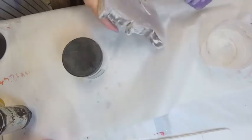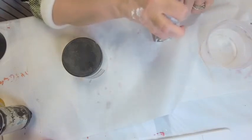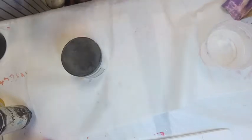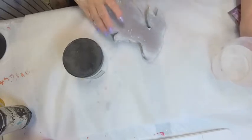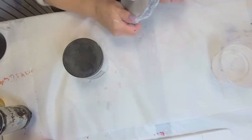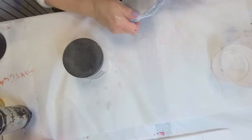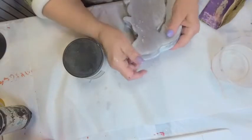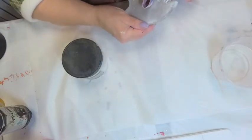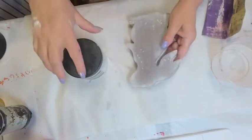You have to realize that wax is the final coat. It's not something you can paint over. If you want a finish that you can paint over and still want to wax, I highly suggest you use a top coat and then wax, because then you can strip the wax easily off the top coat. But if you're doing it where the wax will actually penetrate the wood, you can't just strip that off by sanding — sanding heats the wax and pushes it further into the grain.